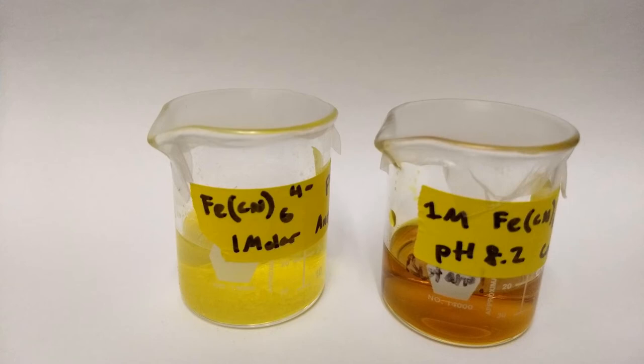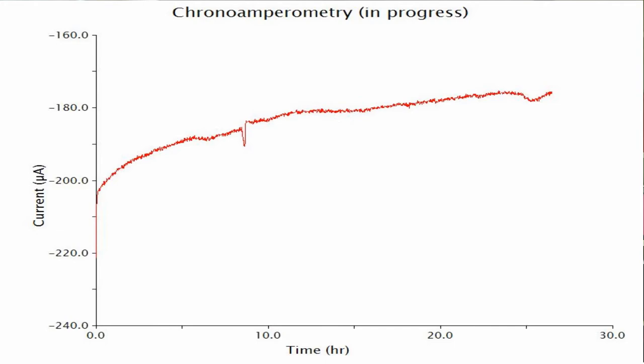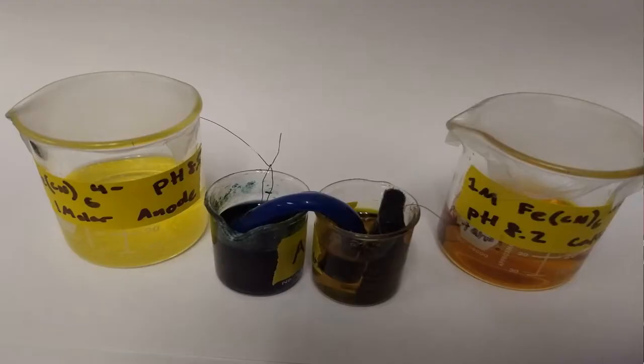The reason I expected that the cyanide would be better was because cyanide looks to be much more soluble. If you look at iron 2 and iron 3 cyanide, there are these very clear solutions — there's a little bit of precipitation on the iron 2 cyanide that could probably be remedied with some minor tweaks to the pH or chemistry. So I really thought it was going to do great in solution. But as I have run it over the last two days, it has slowly lost potential, probably because the anode is becoming saturated with some precipitate. It is blue — unlike the charged state, which is yellow — but as it discharges it turns blue. Probably something building up that is slowly degrading the performance.